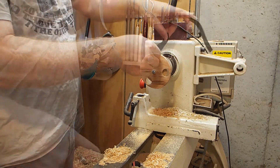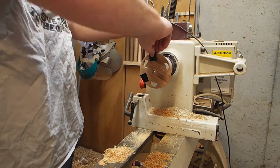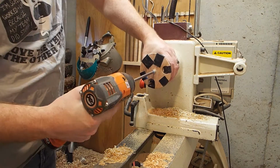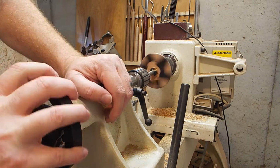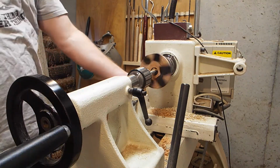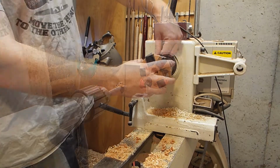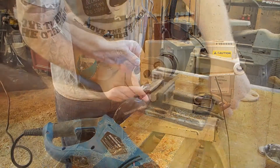While the body is still held in place with the screw, I tape the body to the waste block as tightly as possible. With the body held in place with the tape and the screw removed, I bore out the center for the bearing. Now I have a funny flying saucer-shaped spinner body.